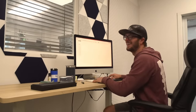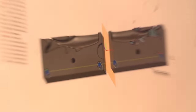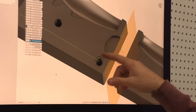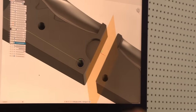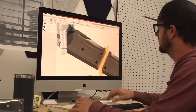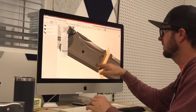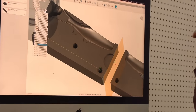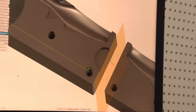Our pinholes — oh, I forgot our pinhole tool. It goes down like a spiral and machines those where the pins come out of our mold. There's like a little ring around there. I do that so it's a visual cue — mainly so you know where the pins go rapidly, and so if there's ever like debris or if I'm pressing a pin in and it kind of dents the surface a little bit, it's down in that little recess instead of bringing it above the surface and then the mold doesn't close.